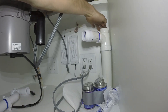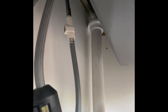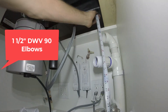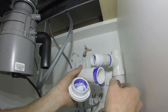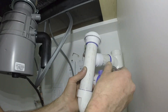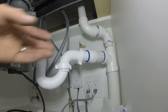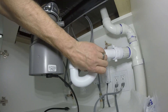It's important to make sure that the pipe is angled over towards the drain on the disposal where it's going to connect. Once the sanitary tee is in place, it's ideal if you can run a pipe straight up from there and put the auto vent on top — you want to get that auto vent as high up in the cabinet as possible. In this cabinet, because there is a bunch of extra structure, I can't come straight off the top of the pipe, so I'll need to do an offset. I'll cut a couple of pieces and a couple of 90s to get that auto vent up as high as possible. Once the offset and the auto vent are all glued in place, I can fit my slip joint P-trap back onto the garbage disposal and tighten everything up.